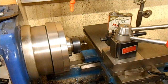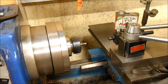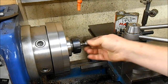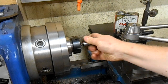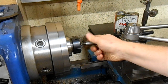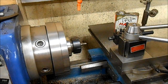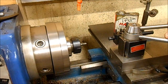From there, a quick file. We should have a little test piece here just to make sure — there we go. It's a beautiful, nice fit. It's probably tighter than I'd normally do for a standard thread. There's about a thou clearance over wires on that, and really nice, quick and easy. No chance of crashing into the shoulder.